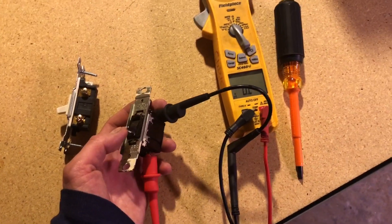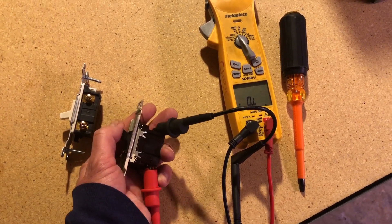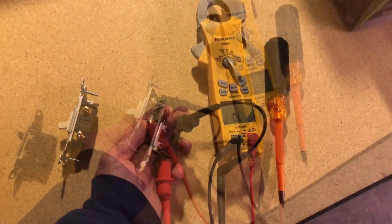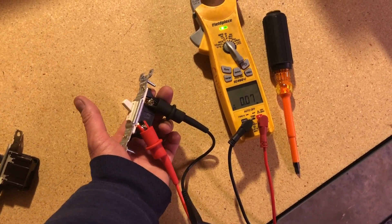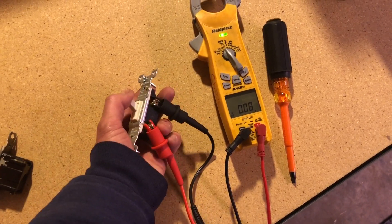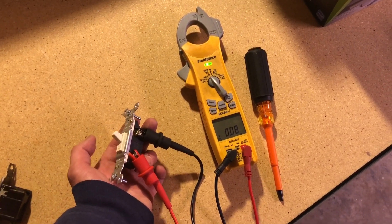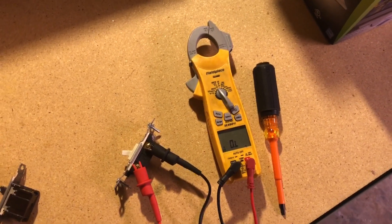If this switch is good you will have continuity — that's all it is, that's all you do to check a switch. Especially ones like this because it's just a single pole — not double pole or triple pole — but either way it's the same method. It's either on or off, and if they don't work, the switch is bad. Here we hooked up to our new switch — very simple: off position, on, off, on. You've got continuity, that's it.